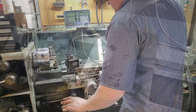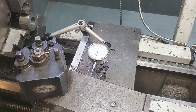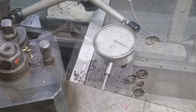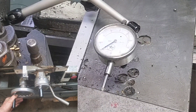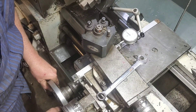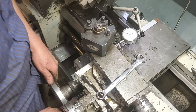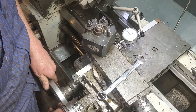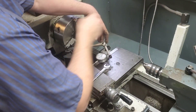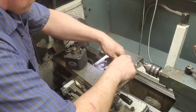For a really fun, easy setup for the taper — what I'm doing here, and we'll later find out I made a small mistake, is the difference between the top and the bottom was 80 thou. I'm moving my cross slide back and forth one inch, then slowly adjusting my compound in increments until I get that 80 thou over the one inch. As soon as I have that 80 thou over the one inch, in theory that's gonna give me the exact taper I want. Some of the more experienced machinists have probably already spotted the error — it's a very common error for new machinists and even some more experienced ones like myself.